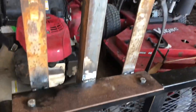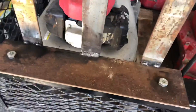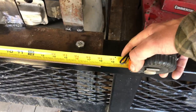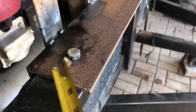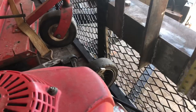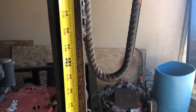Here it is without the blower on it so you can see easier how it is. Don't mind my not-so-pretty welds — this one's not too bad but I'm still getting better at it. The first thing I'm going to do is build a base about 18 inches wide, so I cut the bigger piece — this is a four-inch angle iron, but you could probably get away with two-inch — just enough meat to sit on top of the trailer. I basically cut this piece in half at about 18 inches, and then the other angle iron is about 28 inches.